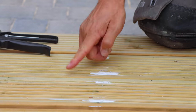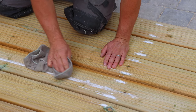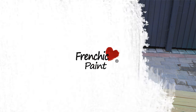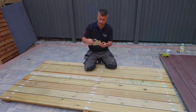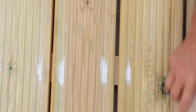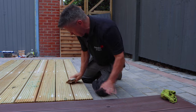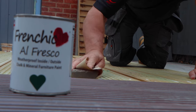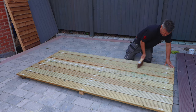Although these planks are new, I've noticed a large crack right the way down the centre of one of them. It's in between the grooves so I'm going to apply some filler and smooth it off with the damp cloth. I'll leave this filler to dry overnight before painting over it. Now the flexible filler is dry — I'm going to give it a light sanding with a sanding sponge and P150 grit, just a very light pass over the filler and to check for any splinters on the new timber. Once the sanding is complete I'll give it a dust off and it's ready to paint.